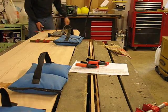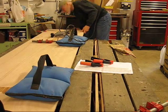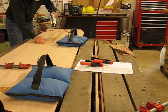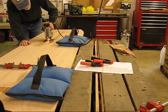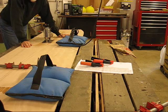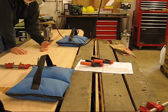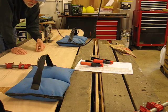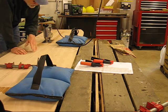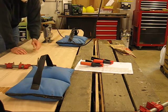Shove it ahead and check to see if the line is still underneath. Just basically stay on the waste area between the two panels. Stay off maybe a sixteenth to an eighth, depending on how good your eyesight and your saw control are. Then we'll come back and either rasp it down or hand plane it down to our lofted pencil line.